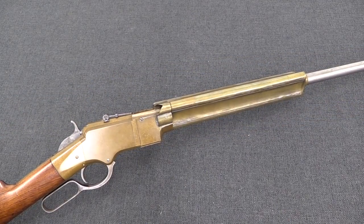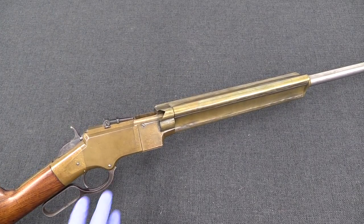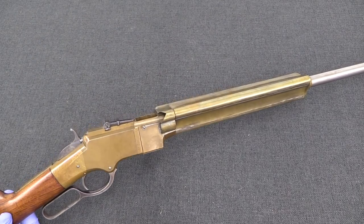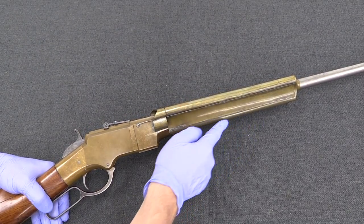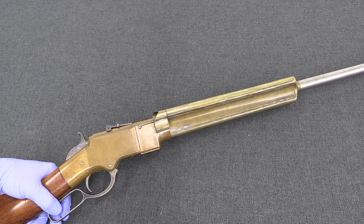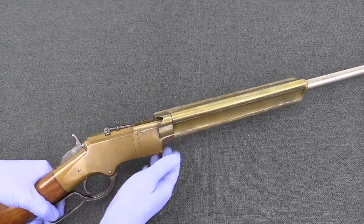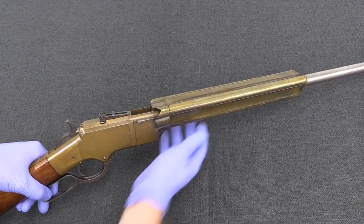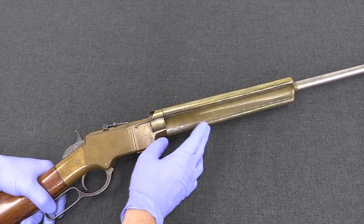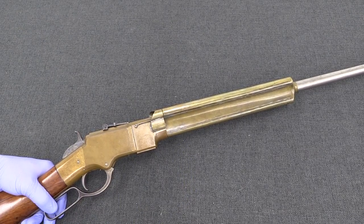There's actually more to this than just the idea of increasing the magazine capacity. One of the faults of the Henry rifle is that you have a follower tab that's always sliding down the bottom of the magazine tube, and you have to be aware of it and move your hand around that follower when the magazine is getting close to being empty — colloquially called the Henry hop. With this you don't have to have a separate follower tube or a follower tab, because it loads from the back instead of the front like a traditional Henry. So that's a nice improvement.